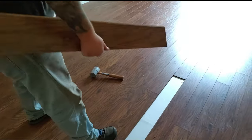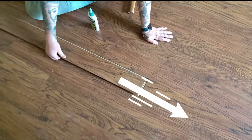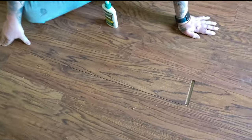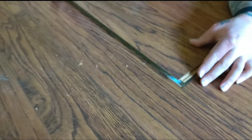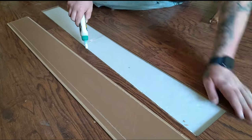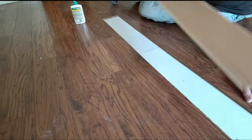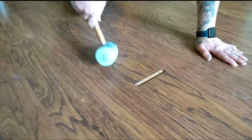As you can see when he cleans it off with his knife, it's a nice flat area we can glue to. We've got the Titebond. We spread the end joints out so it can just go in. Now it just drops into place. We'll glue it and then we'll close the ends. Nice bead of glue — put the board in just like you would install a regular board and now you just push it right into the glue. The ends will hold it in place.